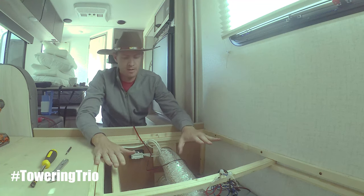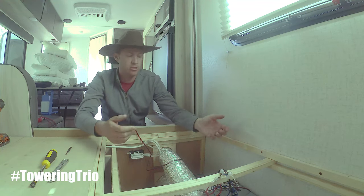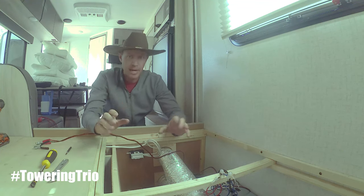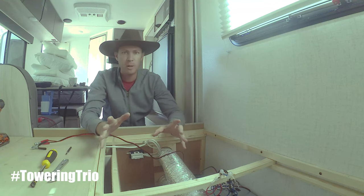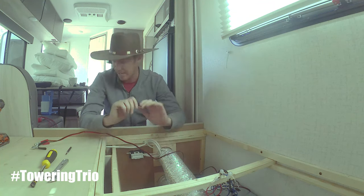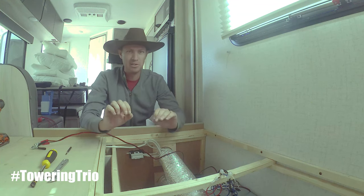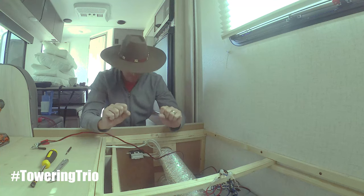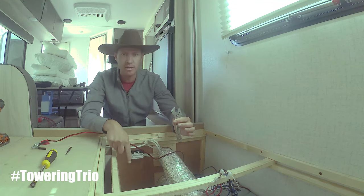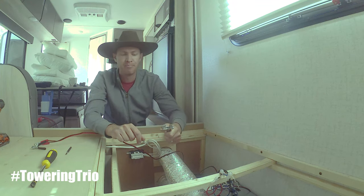We're back here. I'm going to show you how to remove your furnace to access the control board and where the sail switch needs to be installed, and how I connected my two jumper cables to bypass the sail switch. This is a temporary solution to get you by until you can get the part you need — don't leave it like this permanently. Make sure your gas is turned off before you do this, because it's going to release some residual gas in the line, otherwise you'll be filling your coach with propane.